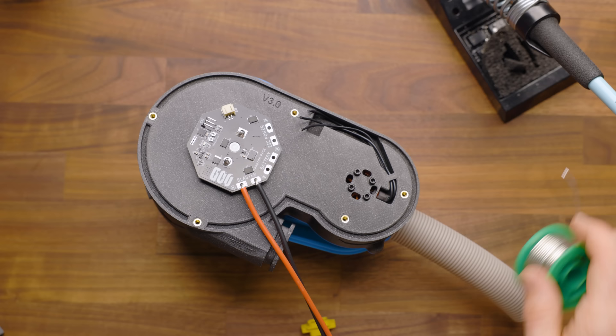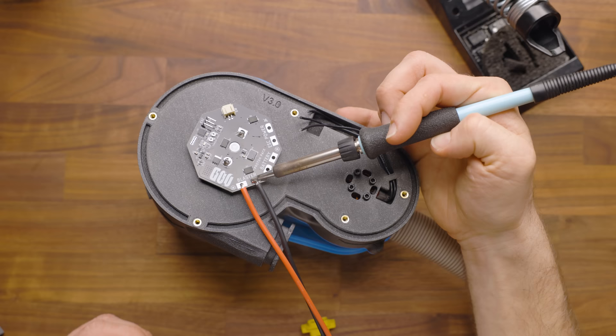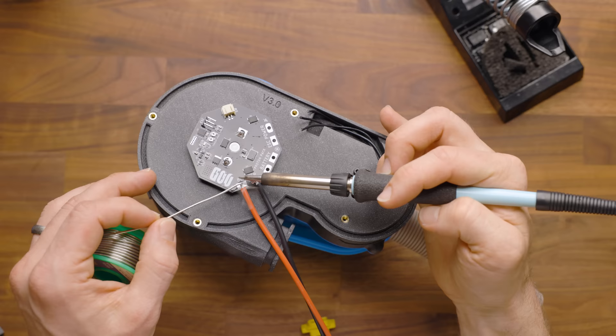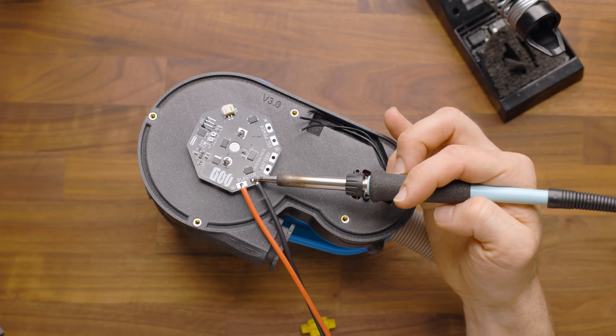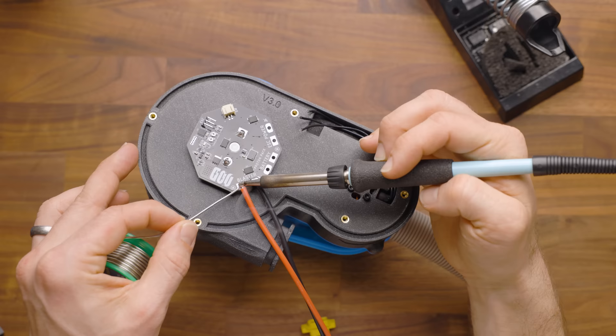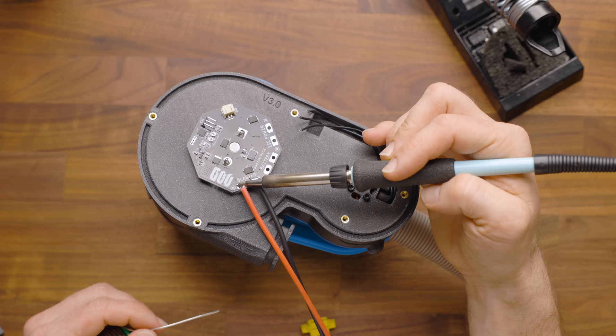Anytime I can not set helping hands up, as long as I can do a good job, it's just faster. You're going to solder right to these pads. These pads are designed to solder directly to the surface — you don't have to insert it in. With all soldering, the biggest tips are make sure your soldering iron is well cared for. Take care of your tips — replace them more frequently than you probably think you need to, though it really depends on how much you abuse them and leave them on when not in use.